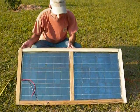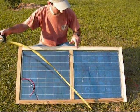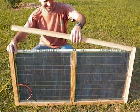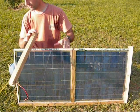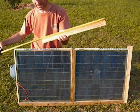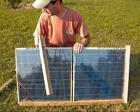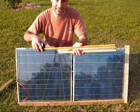This is basically what your solar panel frame is going to look like — or what mine looks like anyway. The back pieces, of which we have two, are exactly 41 and 3/4 inches long. The end pieces are 21 and 7/8 inches long, and we have two of those. Then we have the center piece, which is channeled on both ends so it fits nice and snug. This center piece is just one piece and it's a little smaller — 19 inches long.